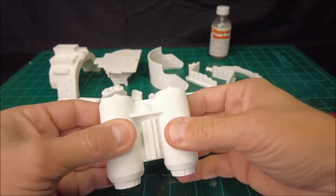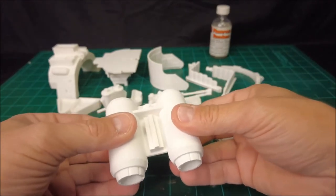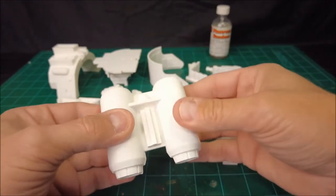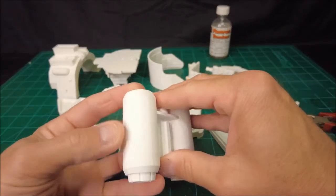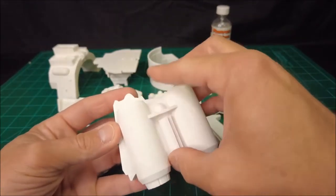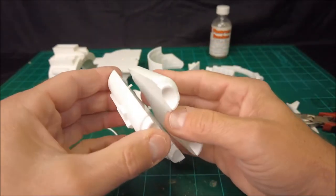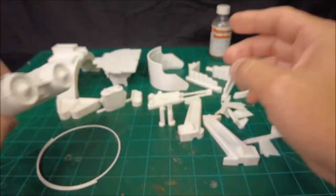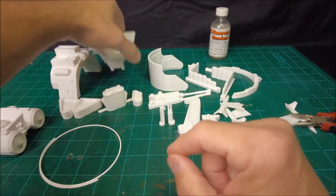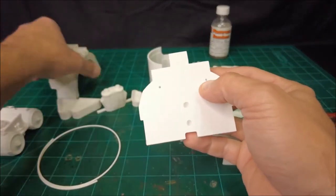Sometimes you put the cement between the two halves, and they get a little bit slippery until the adhesive starts to actually bond the pieces together. And while that happens, it's easy to get things sort of offset a little bit, kind of sloppy. So those alignment pins, or alignment dowels if you want to call them that, are there for just that purpose. And many of these pieces, actually most of these pieces, feature some number of alignment dowels.